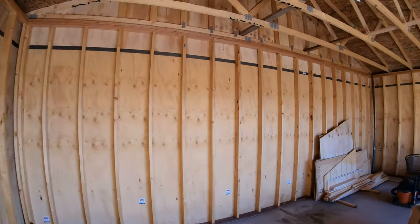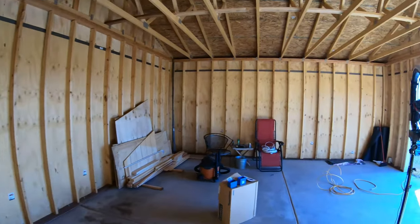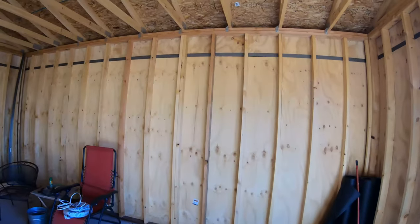I'm going to put the electrical panel here because it lines up with the main panel where I'm bringing the feed in for a sub-panel. Coming off this, each wall is going to have one circuit line. This side wall will have one home run line, the back wall will probably have two lines. A home run line is the line that takes care of all those outlets back to the box. The lights are going to be a whole separate line all the way around. We'll put outlet boxes for plug-in lights so I can move them if needed. Let's get our story stick and go around marking these out.